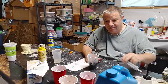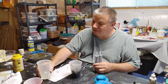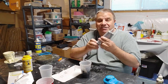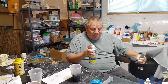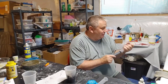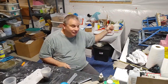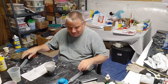I'll explain what I'll be doing because I'm going to do it in a hurry. I will dump Part A into Part B and stir it up — this has to be done quickly because I have a three-minute pot life on this. I will then suck it into syringes — I should have remembered to spray a little mold release on them first — and then shoot it into that hole in the mold and put the plug in and turn the machine on. Let's hope my phone doesn't ring in these three minutes.